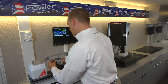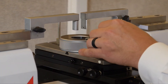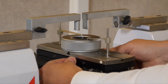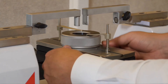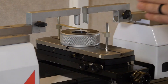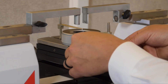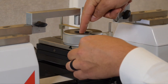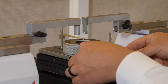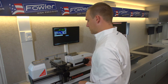This just gets mounted on the table here. We do want to lock that to the table with our quick clamps, and you want to loosen these two side knobs to give it some float — because if it's locked to the table and we don't have that float opened up, it can't come into contact with the left anvil. Just a quick test to make sure we're set up right: you want to make sure that the left side is able to pass the position of the left anvil, which this does handsomely.